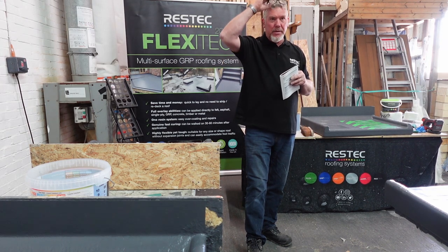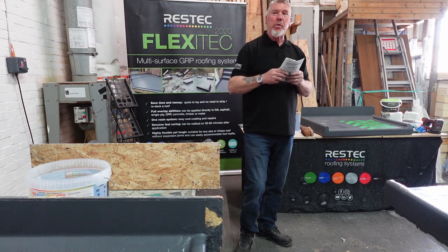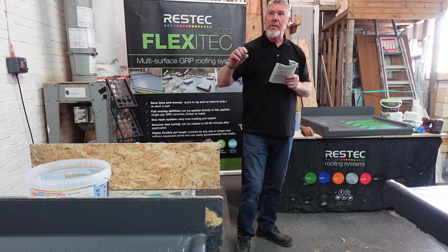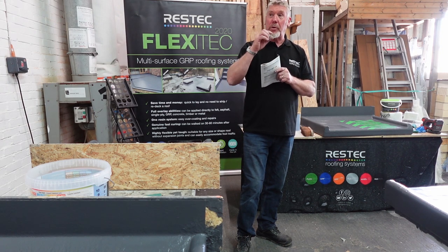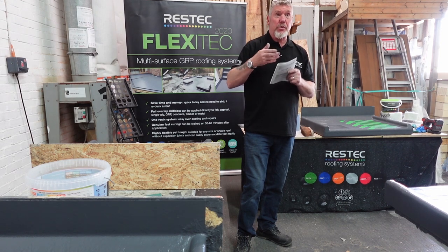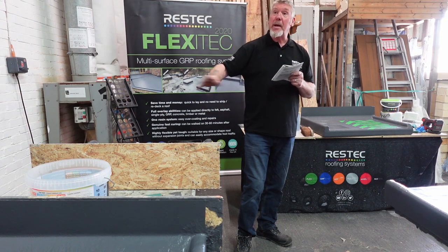Now, you've all witnessed, probably indirectly, polymer migration. If you've ever used any coloured silicones against a bitumen surface and the coloured silicone starts going brown and brittle, that's the bitumen actually migrating. Even though the silicone's set and the bitumen's set, it carries on working. It's just a chemical reaction between the two. But polymer migration is what damps your roof, so you need to prime it down.